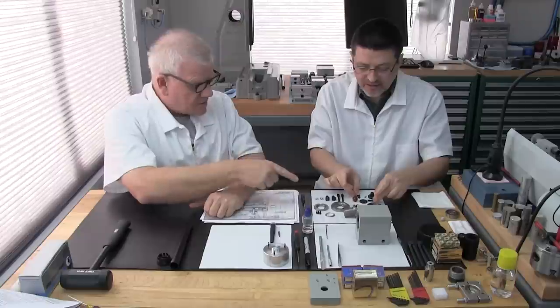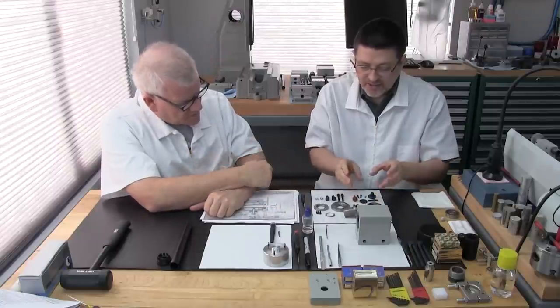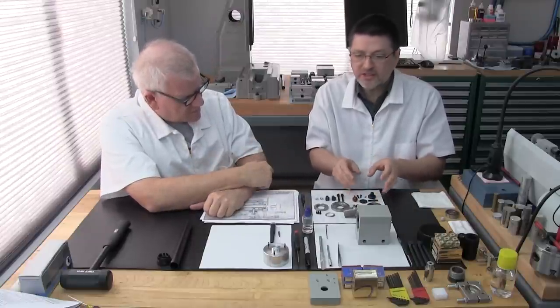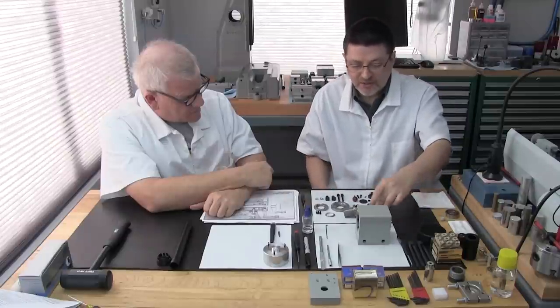When they designed the locking plunger, they designed this assembly really heavy duty. So you can use this to lock the spindle when you install the spindle nut. We've talked to Levin, and Levin also does that when they assemble their headstocks. So it's a procedure that even Levin uses.